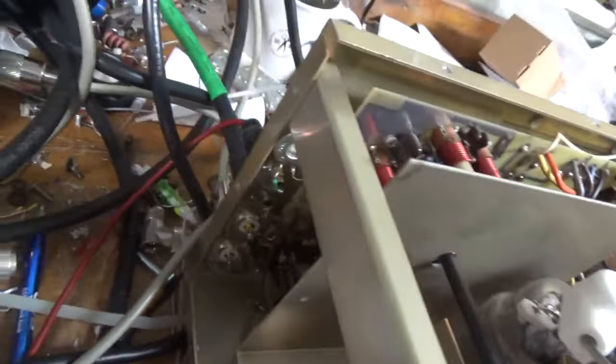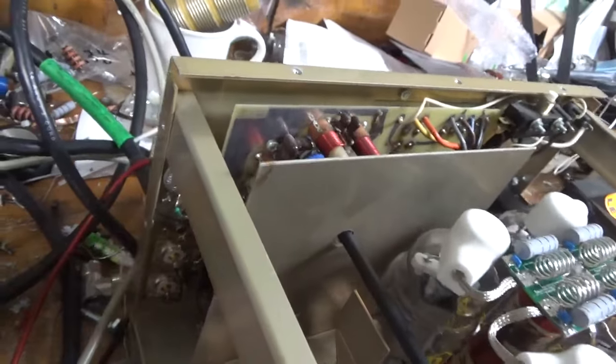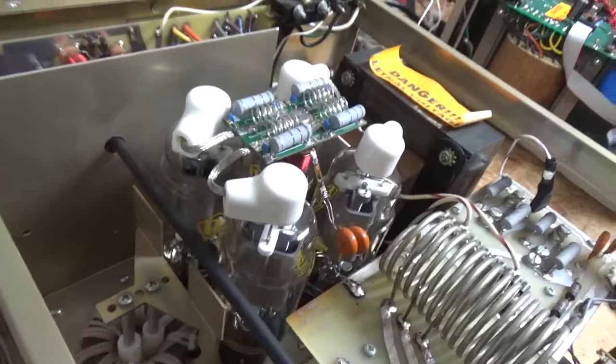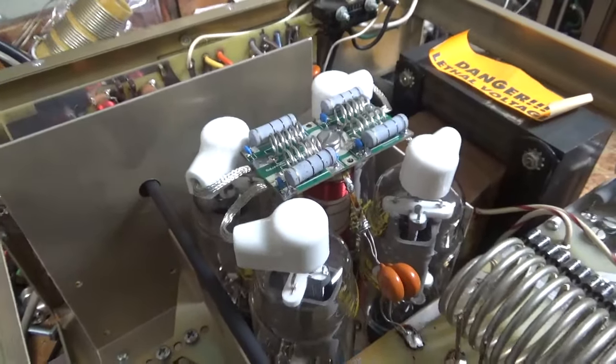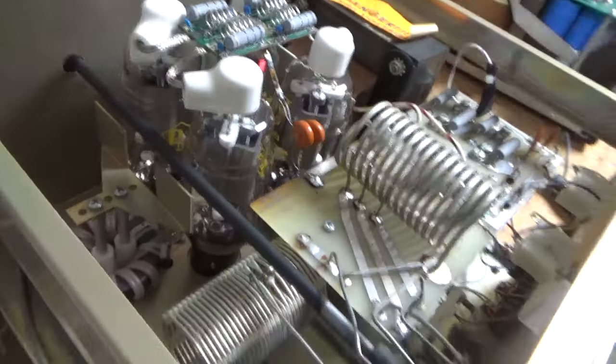So the wire was broken for the key line, so I resoldered it when I went to try it. It wasn't keying, and luckily it was simple. So fixed solder joints. Put a longer screw in the base of the plate choke. Tightened up on hardware. Cleaned the output rotary switch with DeoxIT Gold. Input rotary switch with DeoxIT Gold. Tweaked up on the input tuning on a couple bands.